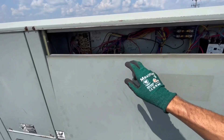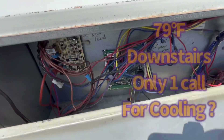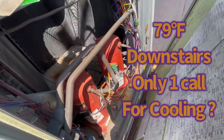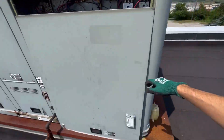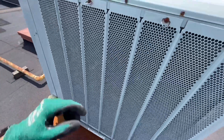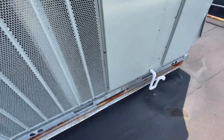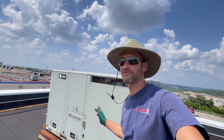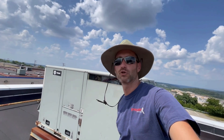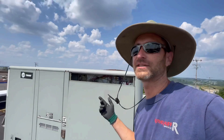Okay guys, this thing's been running for roughly 10 to 15 minutes now. I see one contactor pulled in but the other one is not. I am not getting a call for second stage cooling. This is a two-compressor unit — one stage is running, another one's not. We've got a lot of heat coming out of that condenser, so I'm liking that. But I'd like to figure out why the second stage is not engaging. I'm going to go down to the thermostat and make sure it's programmed for second stage, or if it's even properly hooked up. Don't just flip a switch and run — take the extra couple minutes to look at the system. I'm going to go down, open up the thermostat, and verify it's wired for second stage cooling. They should be using the Y2 terminal, which is blue.